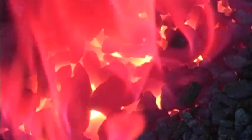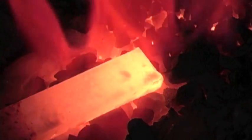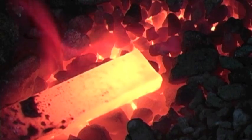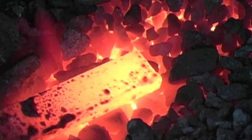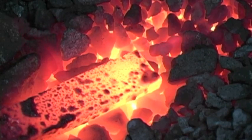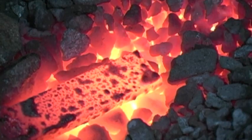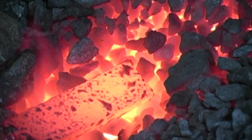I've got a nice bright orange of the coals above and beside my piece. When I bring this out now you can see nice bright orange — the flux is still liquid, it's running around. As it cools or oxidizes, you can see those black spots coming from the bottom of the screen, making their way to the top of the bar. At this stage you're fighting scale — those are going to be included in your weld, and right now you're not going to weld. Look at the way those black spots creep up the bar, the way the air is reacting with the flux forming scale. That scale is a barrier to your weld, so you cannot weld when it looks dry and crusty — it has to look wet. Let's turn it over. Here the flux has not degraded quite so much. There it goes — and now you've got scale forming.